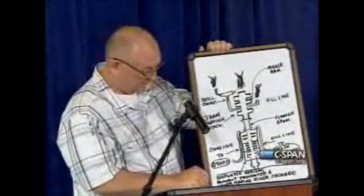That choke line is the last way for oil to leave the capping stack. We will slowly close that — very, very slowly in partial turns — and measure pressure at the same time. In that manner, we will slowly close the entire capping stack and start reading the pressure.